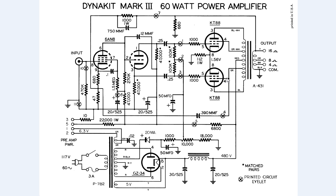Pin 3 and pin 4 are shorted together. This is a unique setup because they're taking the output screen and shorting it to the anode. Once you do that, you take a regular pentode and effectively make it into a triode — this is called a triode-strapped pentode circuit. It actually lowers the anode resistance and lowers the noise of the tube, which means the audio quality improves.